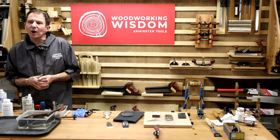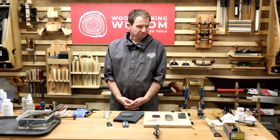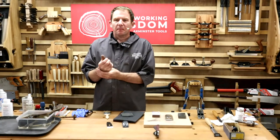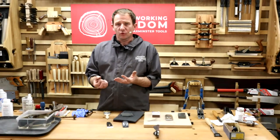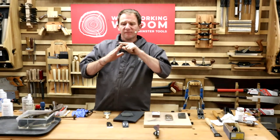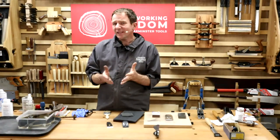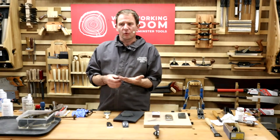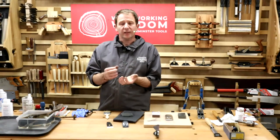Sorry, what bevel angle? In reality, now I'm going to put myself on the line here. If you look at the face you're grinding on a beading tool like the 3/8 and the quarter inch, where you actually get it up to that diamond point at the top, if you looked at the face you're grinding either side, I'd want it to be square. So in reality, you're hitting a 45 degree angle. So a 45 degree angle set on your grinder to your wheel, or if you grind that face in the bevel you're actually grinding, I'd like it to be square.